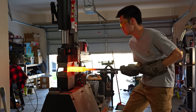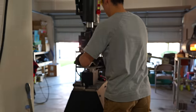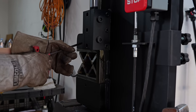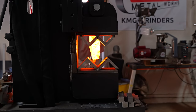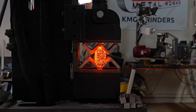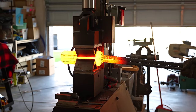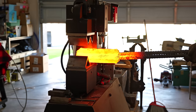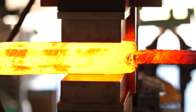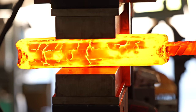After setting the initial welds on my first billet, I'm going to be using my homemade squaring dies and forging down the corners of the billet. What this does to the pattern is drag those outer pieces closer to the center, so that later when I go to stack it, it'll look like a bunch of W's rather than straight lines. I'm actually amazed these squaring dies have made it this far — I've used them on around three or four separate projects now and they haven't shown any signs of falling apart.